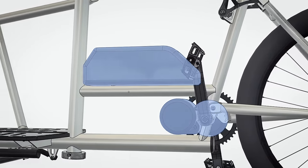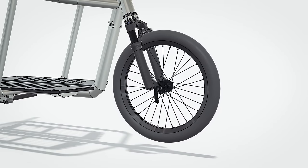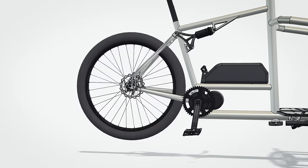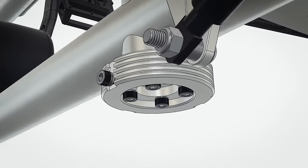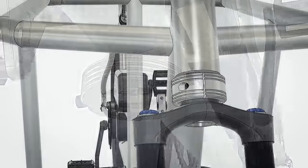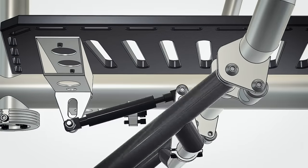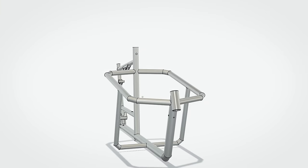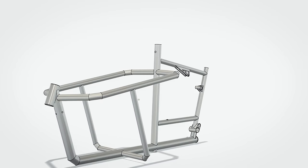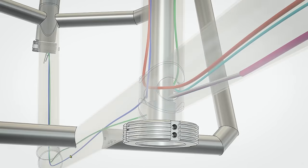The next big feature is that this bike has full suspension for better comfort and ride quality. I also built a cable steering system, which is something I've wanted to try for a while — the steering uses a set of pulleys and cables which are also redundant for safety. We also have a completely new kickstand design, and to keep things light the entire frame and most other parts will be made from round aluminum tubing instead of steel box section.